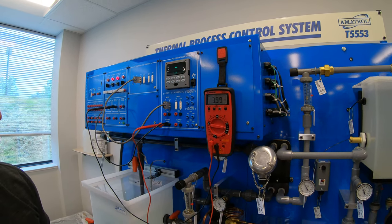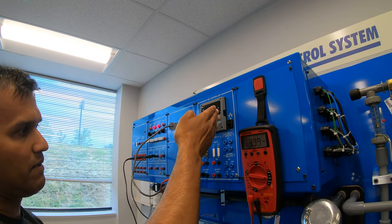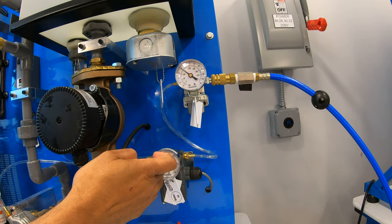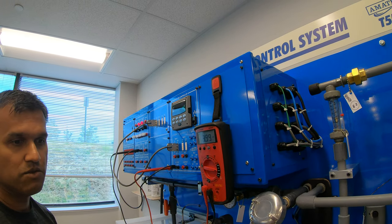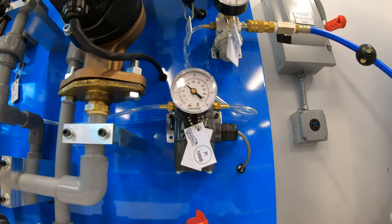If it's at 100%, it'll be at 20 milliamps here. So what we're going to do is, I'm going to increase this to about 100. Once I get to 100, you will see the pressure gauge adjust here — it will increase. And then you will see the current will also increase. So we're going to put the camera there first, and I'm going to increase this to 100 very quickly, starting now.